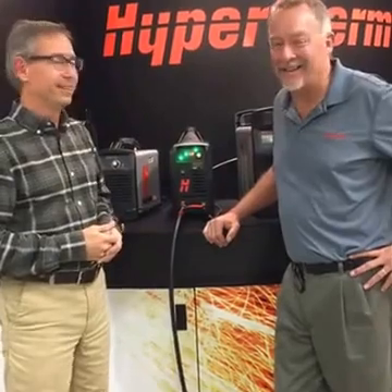There's one other thing that's different from other plasma torches. Since Harry just set this process up and plugged this torch in, when you first trigger it, you're going to get a pulsing of air - that's a warning that the torch is live. Instead of allowing the torch to fire instantaneously, which could be dangerous if you weren't expecting it, it's a neat new feature. It helps change out consumables a lot easier, so you can do it right at the torch without having to go back to the power supply and cycling it. That audible puff of air is a good indication to the user that the next time you pull the trigger, the torch is going to fire. Don't put your finger across it.